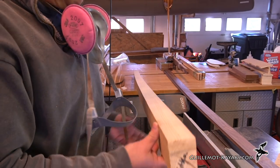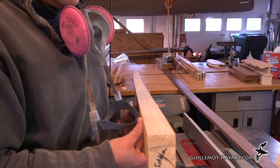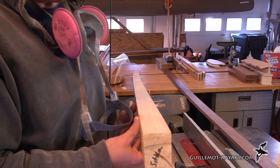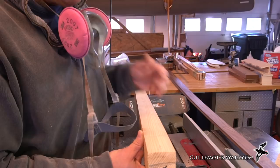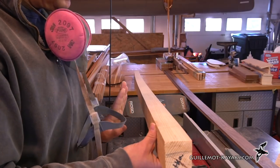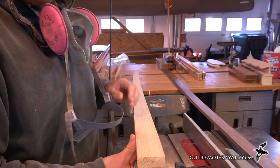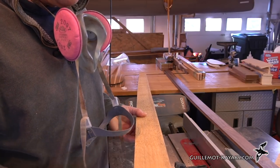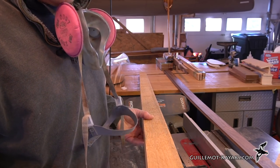With the Sitka spruce here, you see it's got a little bit of a curve to it. Looking down that length, it's got a little bit of a curve. It's not a big deal because when I laminate it together I can laminate it straight. I'll take the two halves, flip them around so the stress balances on each one of them, put them back together, glue them together straight, and they should stay straight. The problem is I'd like to cut this side up against the fence, so instead of trying to straighten it out, I'll just run the curved edge along the fence. Unfortunately this is the rough face, so I'm just going to run this through the plane to get it down to a nice smooth face so it'll run consistently through the saw and we'll have a nice clean cut.